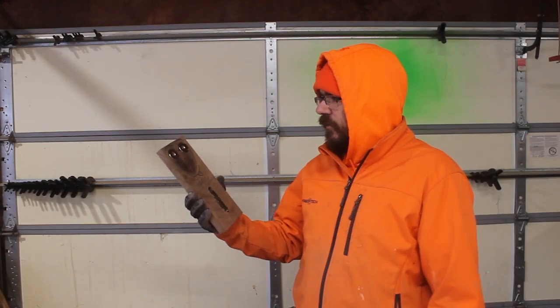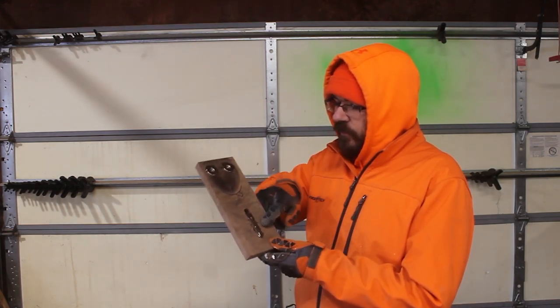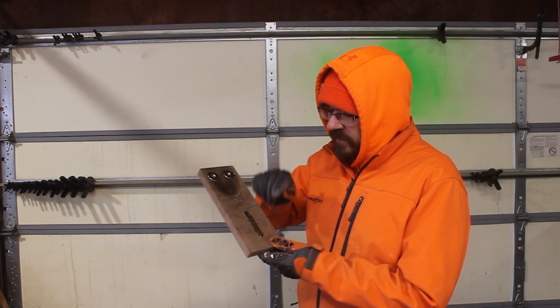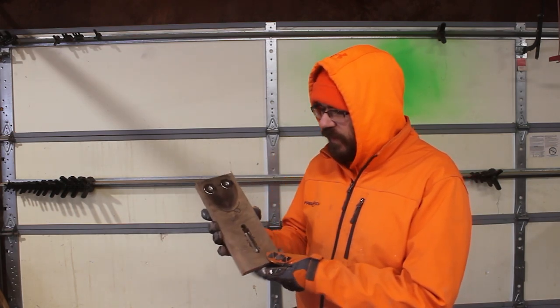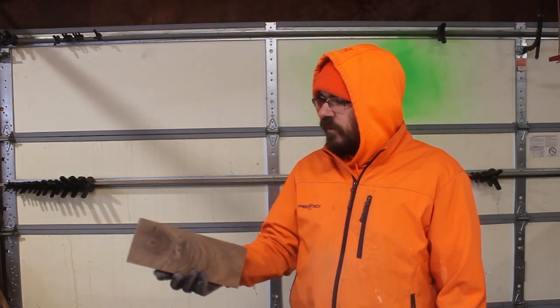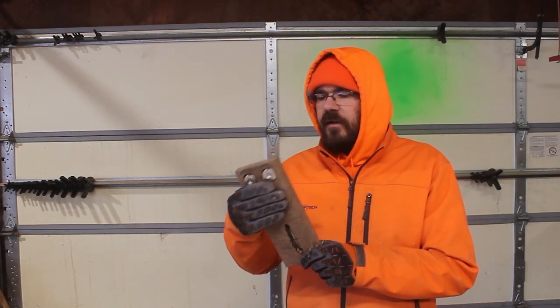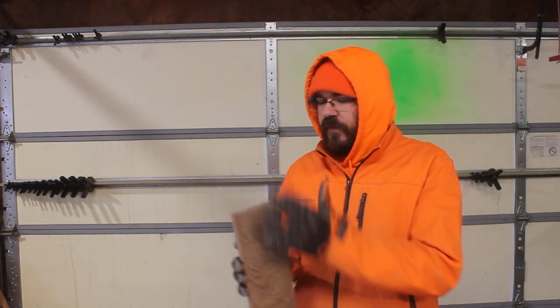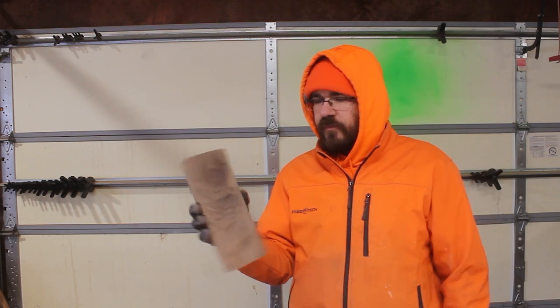You get it. Okay, so now we've got those installed. We've got that epoxied in there. The epoxy is set enough that it's not gonna move around. It's still a little tacky, but it's recessed down in there, so it's fine. So now, it's just a few more steps to the finish line on this one. So we're gonna sand it up to 220, put some cork on the back, and then put finish on it, and then install the actual bottle opener part.